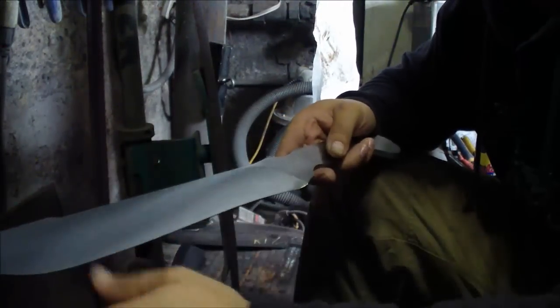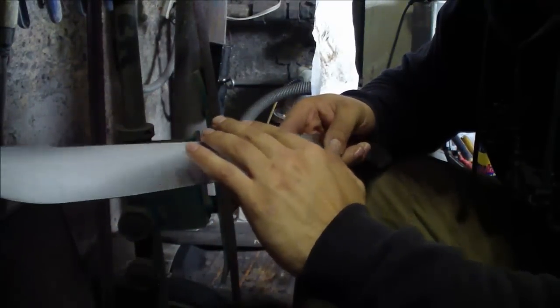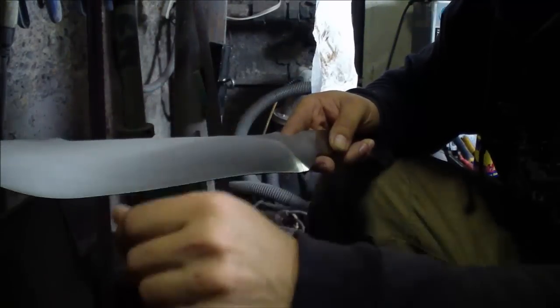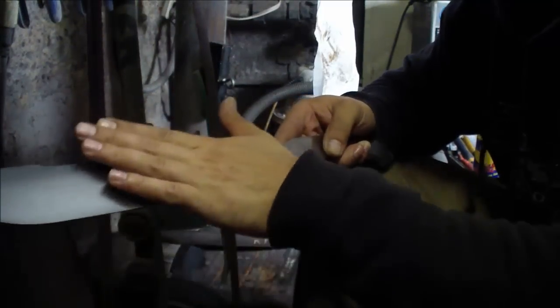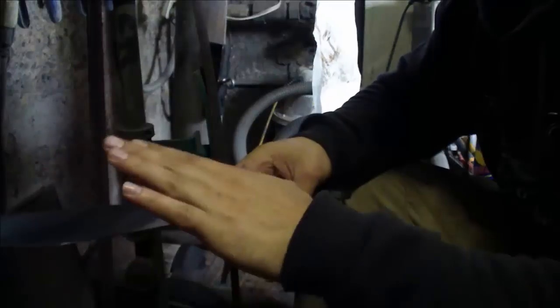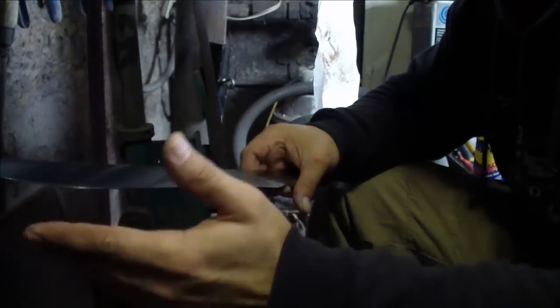And then once you convex it, you see, that's why it's always nice that you get that little rust when you're working with it, because it's like when you're sharpening something and you put the magic marker line to see where your contact is, it's doing essentially the same thing. You have rust flat and you start convexing it. Whatever you already convex, it's gonna be nice and ground. Whatever you didn't touch yet, it's still rusty.